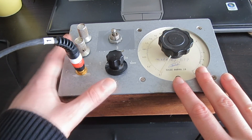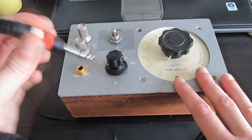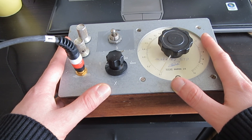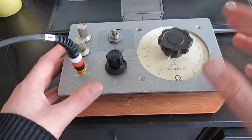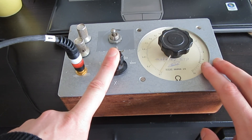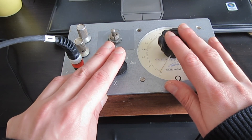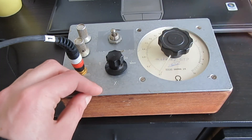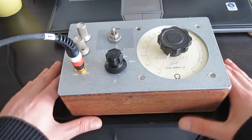Per voice, it has two voices — one on the stereo left and one on the stereo right channel. That's why there's a stereo plug in here. Both voices are exactly the same. They use some sort of three-operator design. The original idea was to make a two-operator synth: one carrier and one modulator, both voltage-controlled oscillators using the 40106, with the modulator frequency-modulating the carrier.